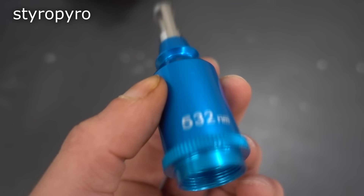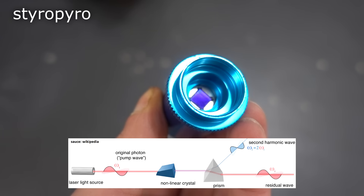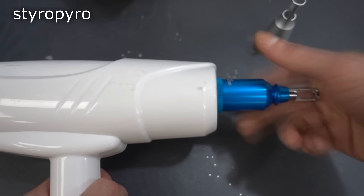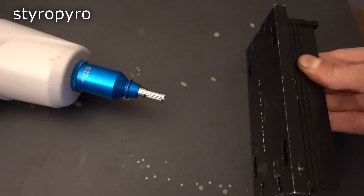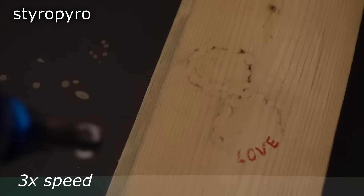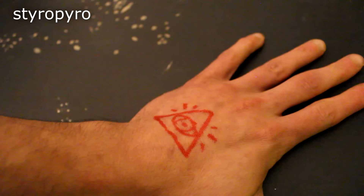That's where this witchcraft comes in. Inside this tip is a crystal of potassium titanyl phosphate, or KTP for short. It splices two IR photons together to make one green photon via a process called second harmonic generation. The fact that you can just screw this onto the tip to make it green is literally insane, because it's usually a lot harder to pull off nonlinear optical processes like this. The green light does a much better job at removing the red ink, which isn't much of a surprise since red and green are on opposite sides of the color wheel.